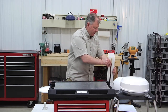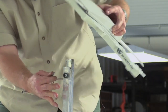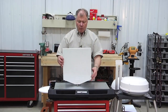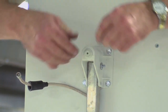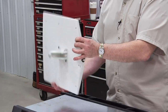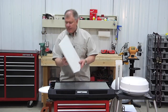To upgrade from that, we have a couple of different versions here. This is a new one they call the Razor. You simply take the old batwing off the mast up on the top — you can even take one of the posts off so you only have one going up. This will give you two directions. When that goes up in the air, you hook your coax to this on the backside where your post comes up. It'll have to lay down flat so it is directional, but the nice part is it doubles the reception area and I also have reception on both sides, so it's a little less directional than the old style.